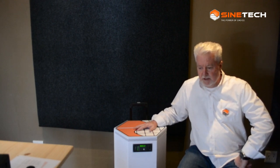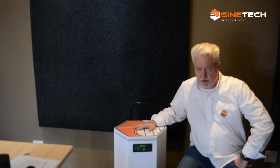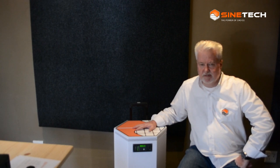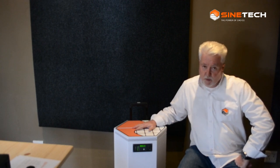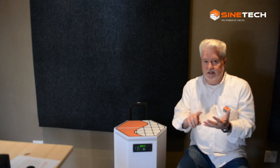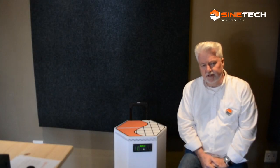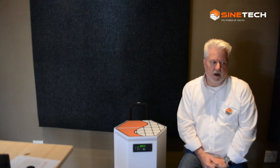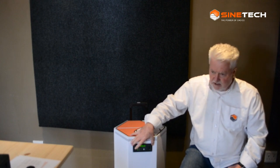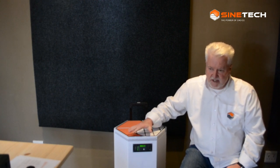It's a 1000-watt unit. Typically in a normal home a fixed system would be between three and five kilowatts, but this one kilowatt unit will back up things like a TV, DStv, a hi-fi system, and a lamp. If you're drawing around 150 to 200 watts you should get about four hours of backup. It also has an intuitive front panel that shows the important info — like battery condition, as a percentage.